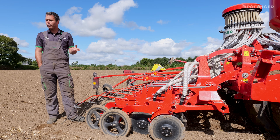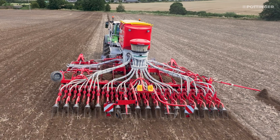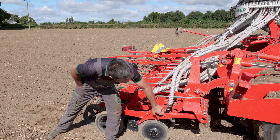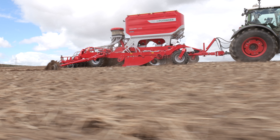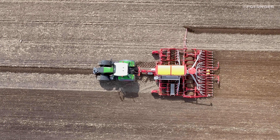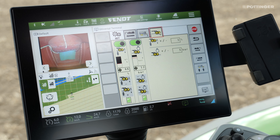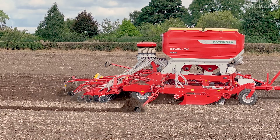For coulters, we offer two options: five-inch or six-inch spacing. We don't say which is better — we give the customer the choice — but the trend we've seen is toward wider spacing, and this machine has six-inch. All Pottinger seed drills use the same coulter arm length inside and outside, unlike some brands that use long and short arms. This ensures equal coulter pressure. We claim 120 kilograms of coulter pressure but in reality it can be closer to 200 at maximum, and it's hydraulically regulated. Seed depth and coulter pressure are all set from the cab display.